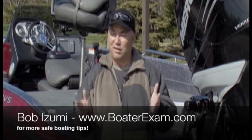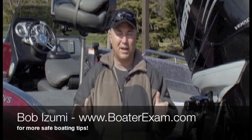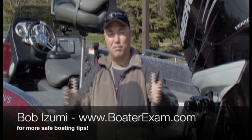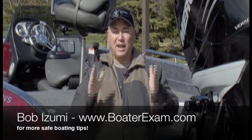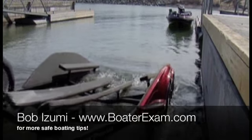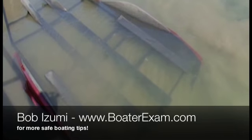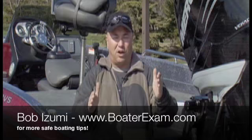When it's time to load, this is very important. The most common mistake I see all over the place when launching boats is people back their trailers in too far where the whole trailer fenders are completely submerged under the water. What happens is they can't get the boat lined up properly on the trailer and it comes up sideways when they pull it out of the water. What you want to do is back it in so that the bunks are about two thirds or three quarters submerged, so they still have some of the bunks out of the water to guide your boat on, especially a V-hull like I'm using here. With the bunks partially exposed, it's a lot easier to drive your boat up onto the trailer and it'll guide itself on so it'll be centered.